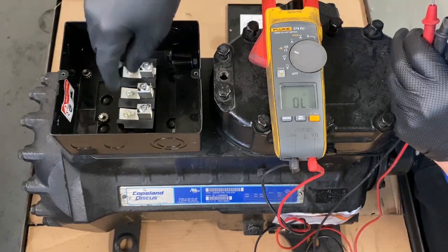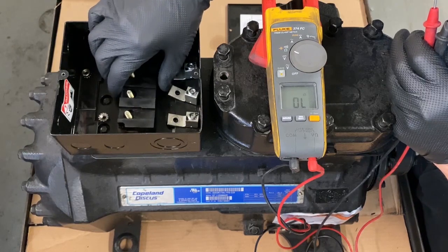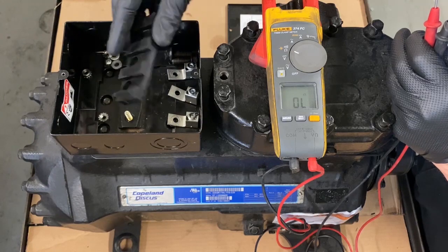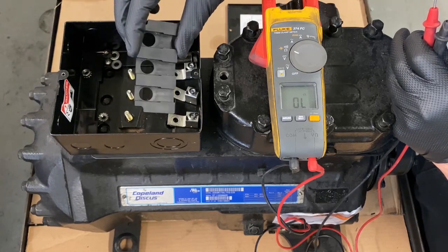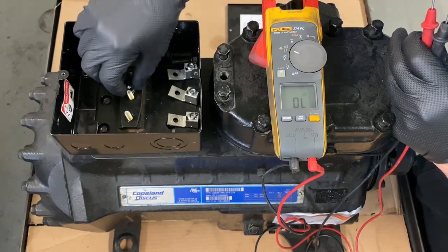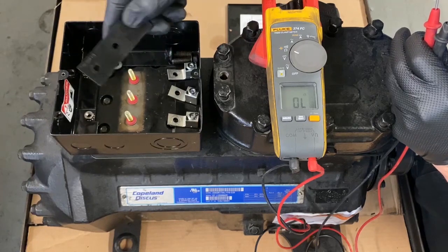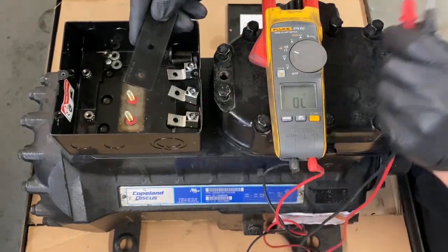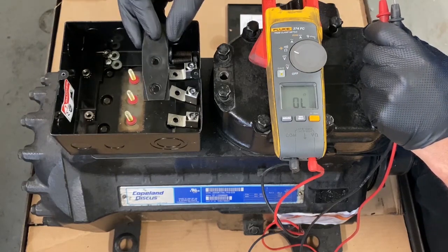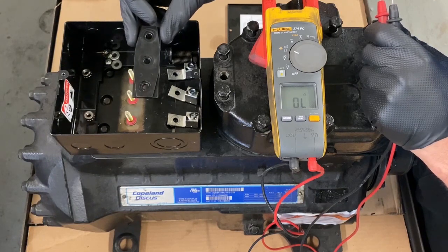See how I've taken off the screws here — let's take this off. This is a terminal plate insulator. Realistically, this could be damaged, cracked, or have carbon tracking — that could be the issue. We take a look — that doesn't look bad. There are screws that go on here that I've taken off. This is another insulator plate; there's even a part number on it. I've seen compressors come back — 6Ds, 4Ds — with failed terminal plates, but the compressors were totally fine. They could have just replaced this.